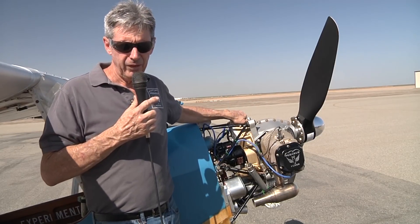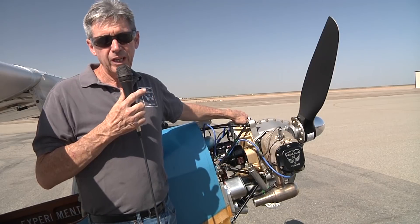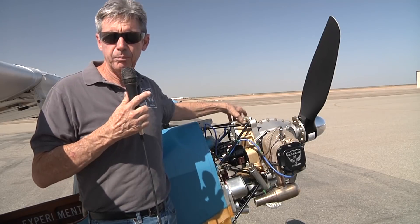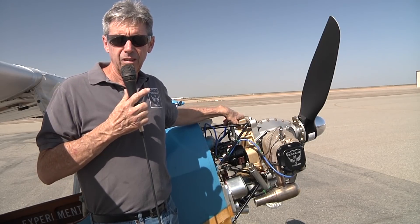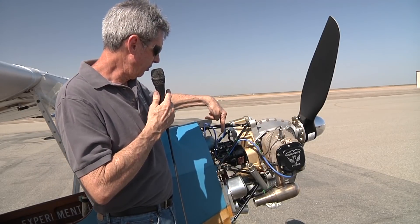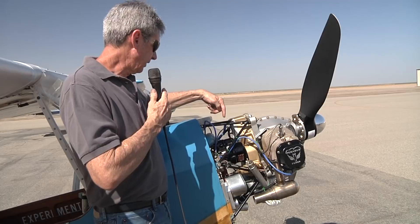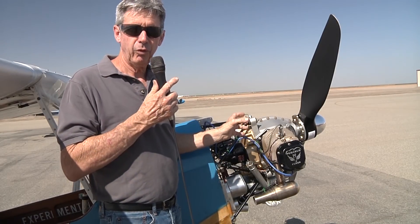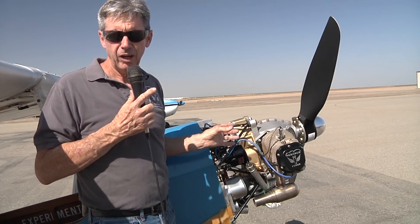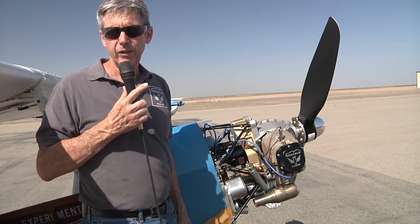The accessory case was an issue because a lot of you were saying there aren't very many of them and they're very expensive to buy new. So I decided to build a plenum chamber onto a proprietary accessory case. It's identical in every way to the Continental — it'll have a starter, two magneto holes, the screen adapter, the tach adapter — but it will have a plenum chamber for the intake manifold on the bottom and a side draft carburetor. Using a side draft carburetor opened it up to many more options, since there are very few updraft carburetors available.